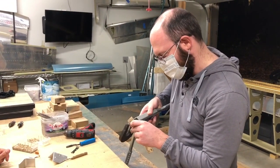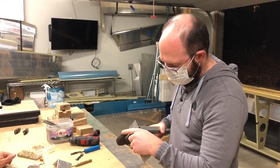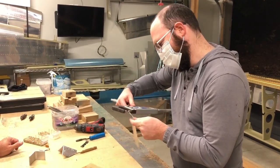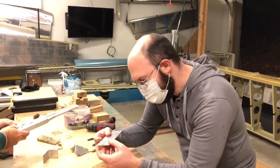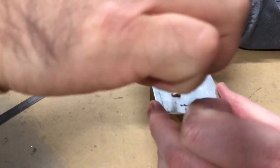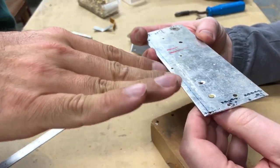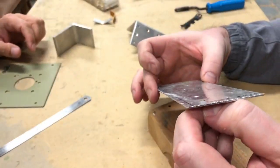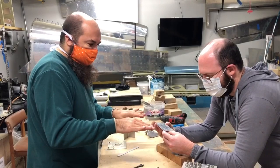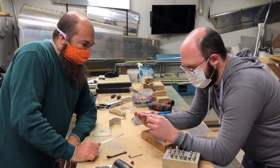I'll do the other hole. Usually the part is on something or in a fixture, so you're not flopping around needing three arms. How do you know if you've under-dimpled? Usually you just put a rivet in and it won't look right or feel right. You can also look at the reflections on the skin — a good set of dimple dies will only deform the skin exactly where the die closed. Everything else is smooth, so the reflection changes right there but is immediately back to normal.